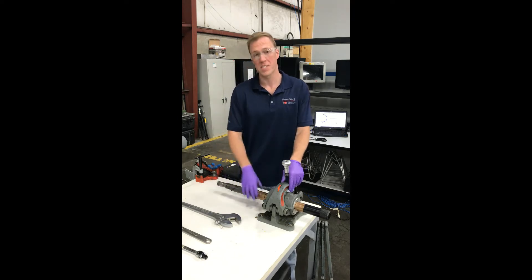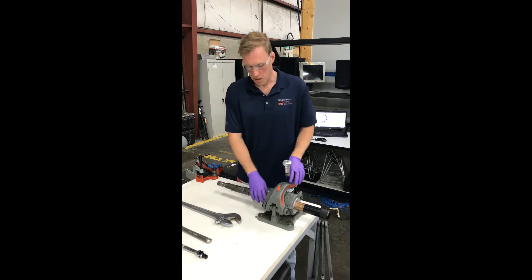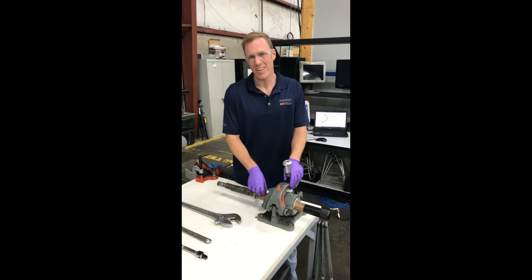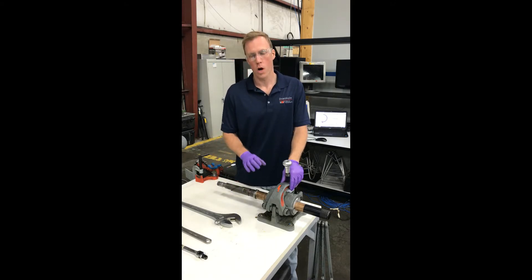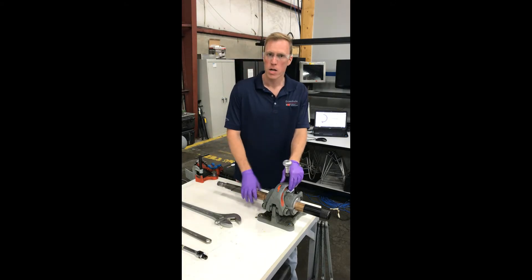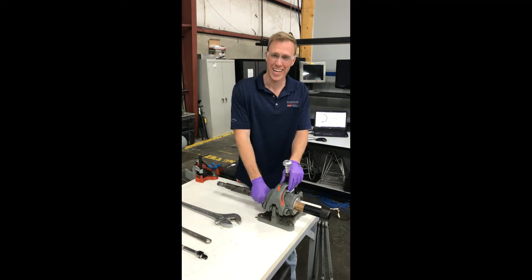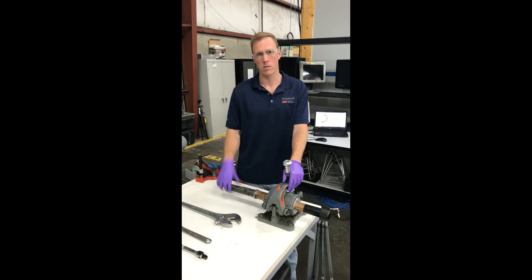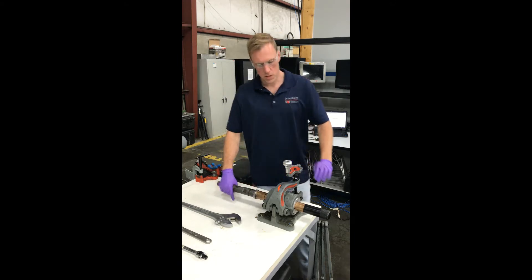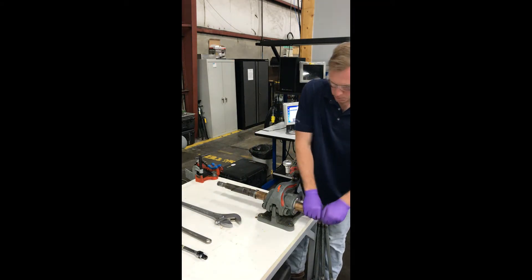The lower end is fairly easy. A couple of precautions: there's a ceramic sleeve inside of the top end of this lower end. You'd want to be careful when clamping on it not to over-clamp and crush that sleeve, but you obviously can clamp on it tight enough to grip it and work out some other components. So the first thing I do is put it in a vise and remove the end cap.